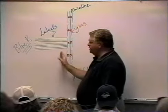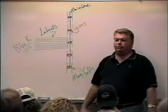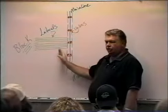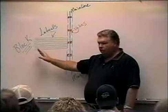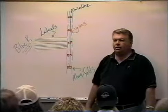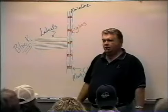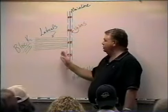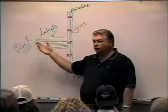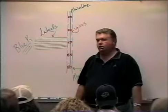When we put this in permanent underground solid set, we can be a lot more sophisticated and start sizing down. We might start here at two inch, go to inch and a half, inch and a quarter, one inch, even three-quarter, even one-half inch. So we have the option to size down as we go out the lateral. It would be pound foolish to have all two-inch pipe when at the end it's only delivering two and a half gallons a minute — why spend that kind of money when you don't need to?